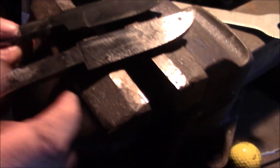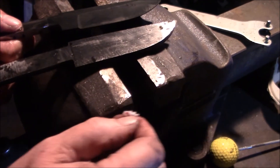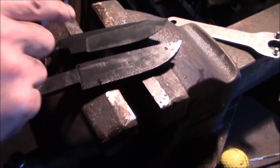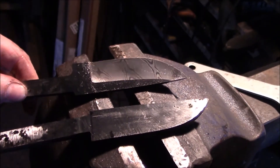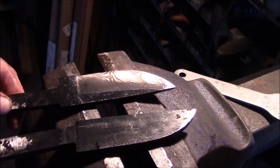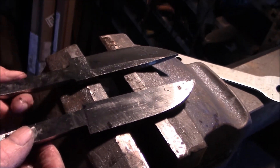See them in there now? This one here still has the big broad stripes and they just go straight down through the side of the knife. This one where I've ground down into it — I've exposed the center of that billet, exposed the core. It's giving me nice U-shapes at the top, nice U-shapes at the bottom, and some star pattern in the center. Same on the other side. Grind down into that side a little further and you'll see almost the same pattern. You can see where the broad bands crossed over themselves in the middle. This other guy still doesn't have a whole lot of action to it. That's the reason why we want to grind down into some of them instead of forging them in.